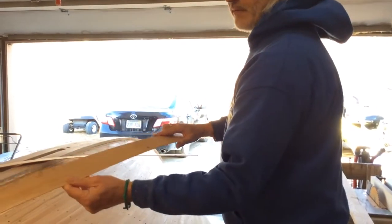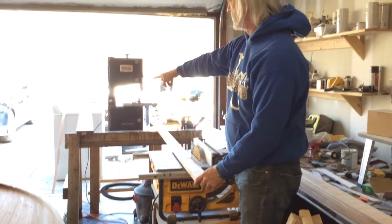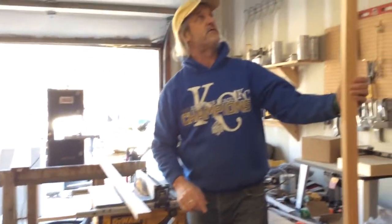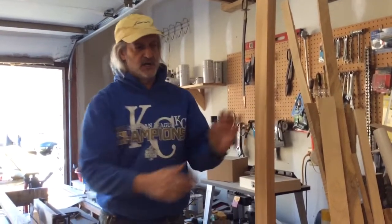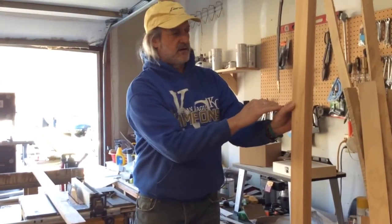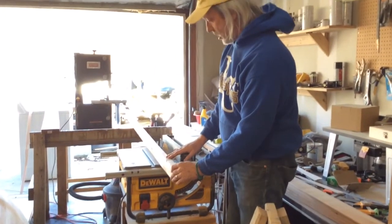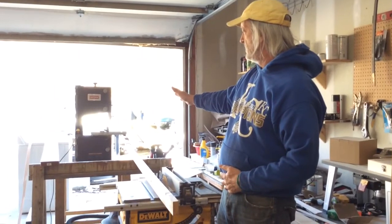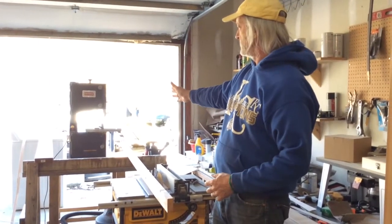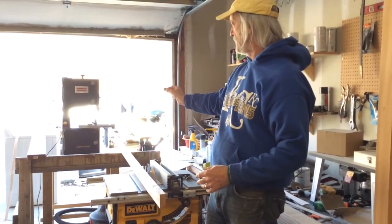These are very uniform, and I was able to do that running them through the table saw. The first thing I did was run a fresh board through and rip it in half — so I had about two and three quarters each, because it was five and a half originally. Then I took the rounded edge off, which left me with a relatively square piece so that when I run it through the saw I'm getting a pretty uniform measurement. The problem with the bandsaw was that the fence is cheap and I couldn't keep it steady to get uniform thickness out of those pieces.